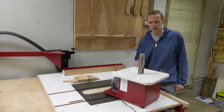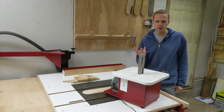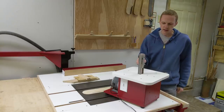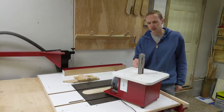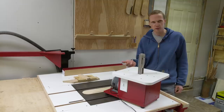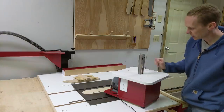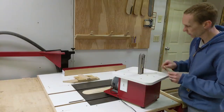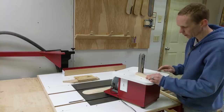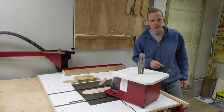There are two more things I really like about this sander. One is the noise — or lack of noise. It's actually pretty quiet; I'm talking in my normal voice and you can still hear me just fine. The main reason for that is there are only two moving parts and no belts besides the sanding belt itself. The lower wheel spins right on the motor shaft so that doesn't make noise, and the upper wheel on bearings is pretty quiet. Really all the noise comes from the sanding belt rubbing on bits of the machine as it comes through the table, and you get a little more noise when sanding a piece — but it's quiet enough that I don't need to wear ear protection.